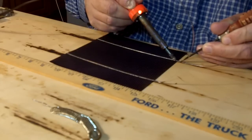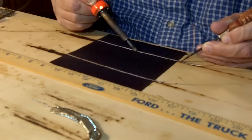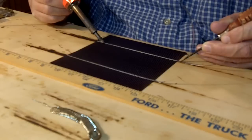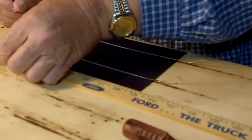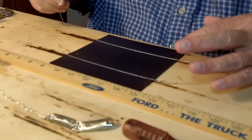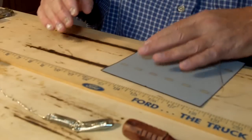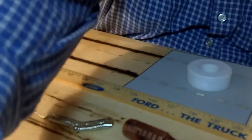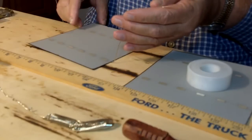I'll make four rows of nine, so nine times four is 36. Each of these cells produces around half a volt, and most people have a 12 volt system. To charge a 12 volt battery you need more than 12 volts — this will put out around 18 volts: 36 times half a volt equals 18 volts. You always want more voltage than what your batteries are. I use two six volt golf cart batteries hooked up in series, which gives me 12 volts.